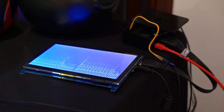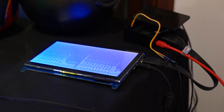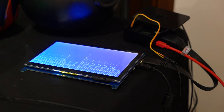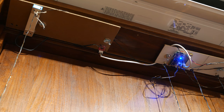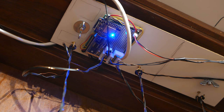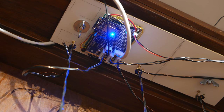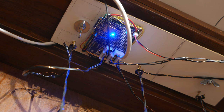Now on the technical side, the game logic is handled by a Raspberry Pi with a keyboard plugged in. I also added a small screen to it, but that was only for debugging. The LEDs and sensors were hooked up to a small board that I soldered together with an ESP8266 microcontroller and an I2C LED driver. This microcontroller communicated with the Raspberry Pi over WiFi, allowing the Pi to control all the LED colors wirelessly and also accept all the inputs from the sensors.